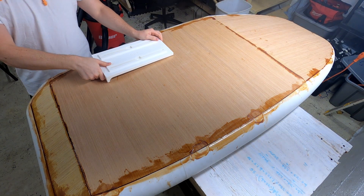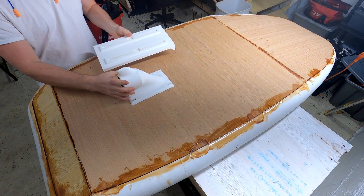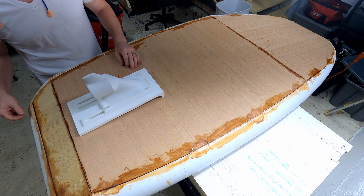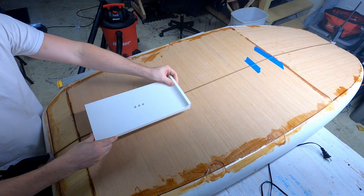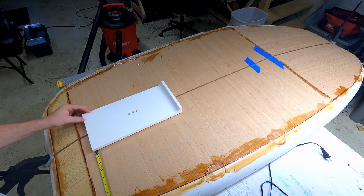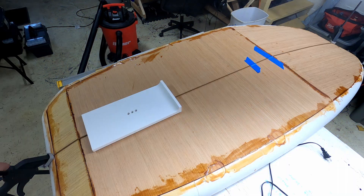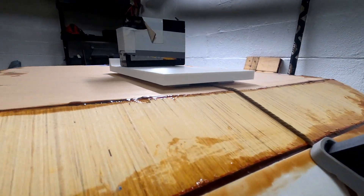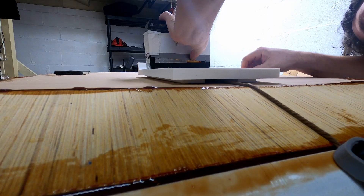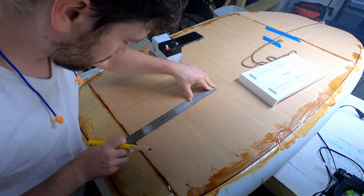We're going to add one of the first 3D printed parts aside from the rim of the board — the mounting plate and also the motor mount that will hold the motor and propeller. I'm getting this centered on the board so we can embed it and epoxy it in with fiberglass as well. The biggest challenge was making sure this was very centered. I started off using a cord that goes across the middle of the board, but it would roll just a little bit, and if I'm a quarter inch off, I'm going to be turning unintentionally in the water. Once I did find center, I traced out the outer lines of that mounting plate, and the extruded parts of that plate will come through the inside to the outer part of the board, giving a nice flush area for the motor mount.